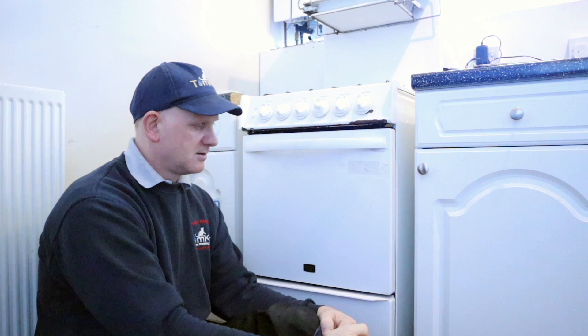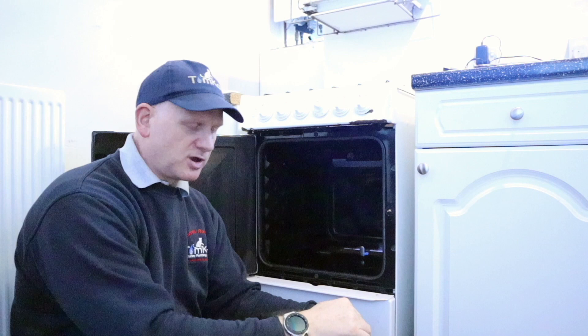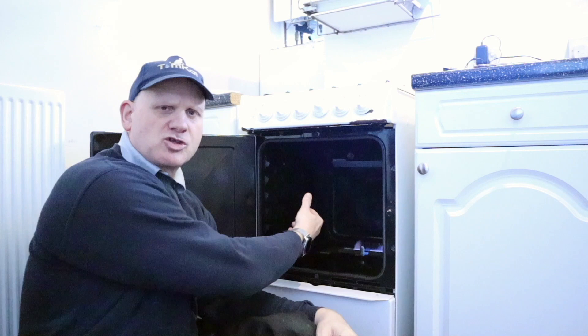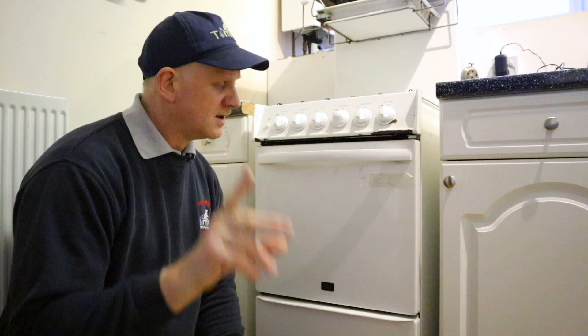It's going quieter and it now sounds like it's gone off. Opening the door, it's still lit but in a very, very low flame. That means the liquid vapour valve is working, the bypass is working, and the thermostat has taken it down to the bypass rate. Now I'm waiting for it to go back up to full fire as the heat escapes — that also tells me the mechanical thermostat is working correctly.